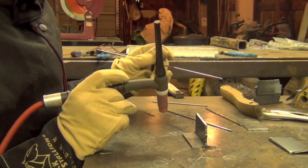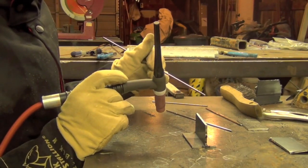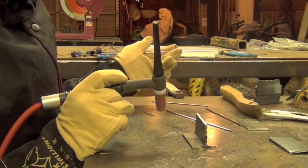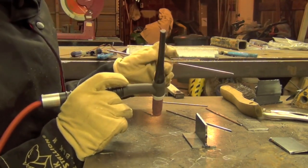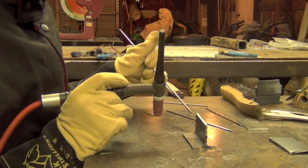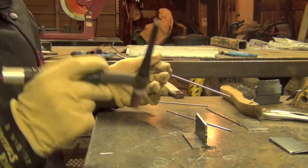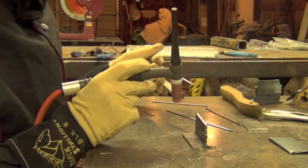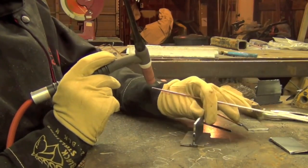As mentioned, the single biggest difference between an inside corner joint and a fillet weld is that we're no longer welding two edges together — we're welding an edge to basically a middle. But aside from that, there's not too much that's different, with the exception that in this series this is a good transition point to go from welding in the flat position with those W-shaped assemblies to the horizontal position, which is when your weld just sits on the table like such.